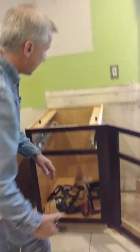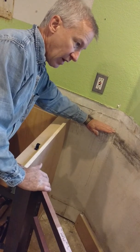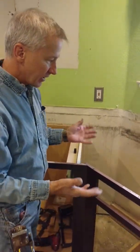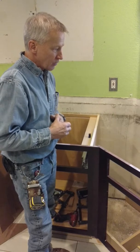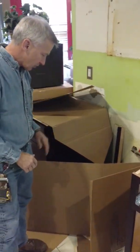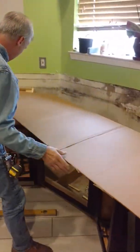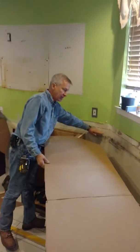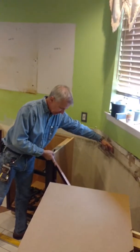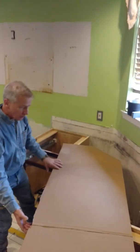The next step is: these angles are close to 45 degrees. You can use an angle finder to find that angle. But rather than start cutting up your material trying to find all these unknown measurements, what you want to do is start with a cardboard template. We've already got one that's ready-made, but I cut another one here so you can see how I started. We know this is a 45 — probably not going to be perfect. We cut this piece of cardboard to this thickness and ran it straight, with one 45-degree cut over here.